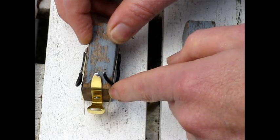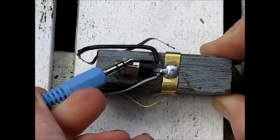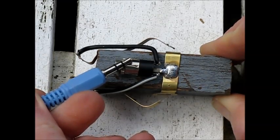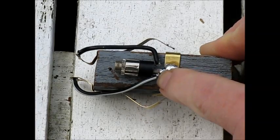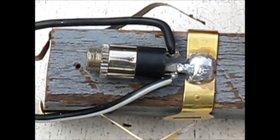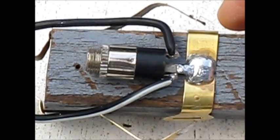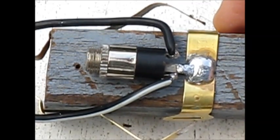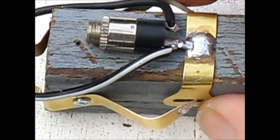Being careful to ensure that the nails do not meet inside the block — that happened to me when I first built this, and it took a while to realize what was going on. Here's the 3.5 millimeter socket for connection to the transceiver. This is the common or earth pin, and these two pins are for the dot and for the dash. Bend the brass so that it is springy and, in its resting position, about 3 or 4 millimeters away from the common contact. Do that for both the dot and the dash side.